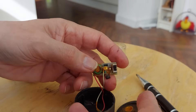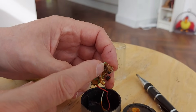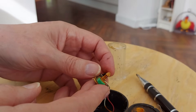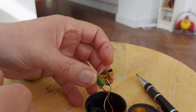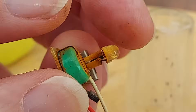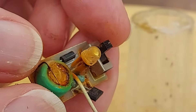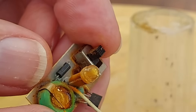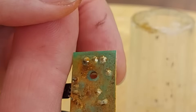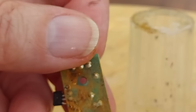Things that usually go wrong with these when I look at them: the on-off switch — regularly the contacts in there are corroded because it all gets wet. I can actually see one leg of the LED that's rusted right through. Let's go close-up on that — you can see daylight. So it's possible everything's working apart from the LED. We could just try a different LED there and see if it works. I'll get some contact cleaner and give it a good spray, clean it up a bit, and we'll see if we can swap the LED.